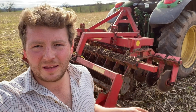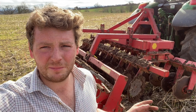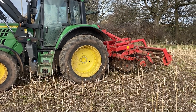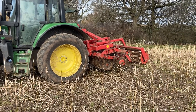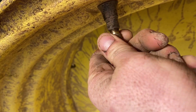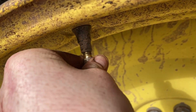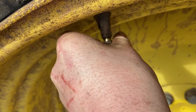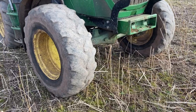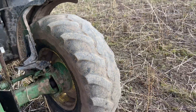I've just set the discs up and they're doing a really nice job. Conditions are pretty near perfect for February. The tractor is now off livestock duties and onto arable duties - I dropped the straw chopper off this morning and the discs are on this afternoon. I'm just going to let the tires down to about 15 psi.